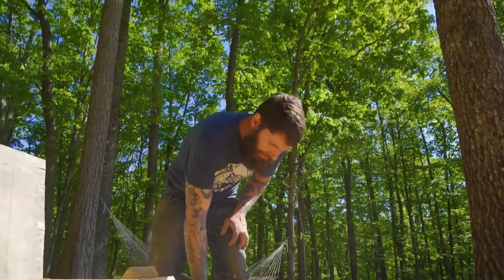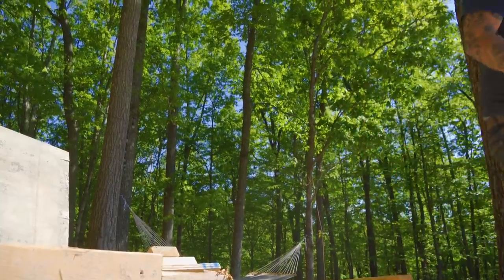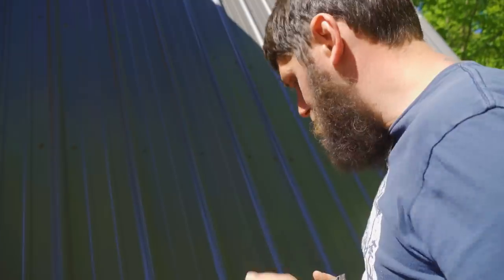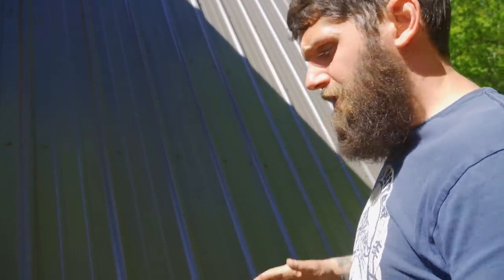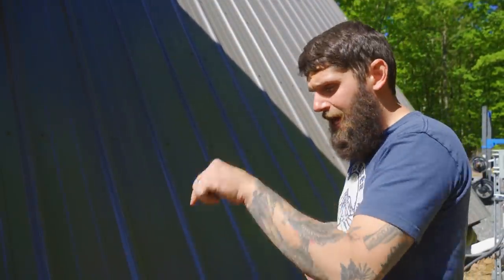This guy is 25 inches. That might go good over there. We could do that on some of these. They're actually a little bit short. We have 2x4s. We can cut them the length of the 2x4 as the width of the form and stack it and just tap onto the concrete and set the new form on top. Yeah. To give us a little bit, maybe do two if we need to, get 3 inches out of it and raise it up. Okay. Versus build a new one. Oh yeah. You know what I mean? Yeah. We can go that route.